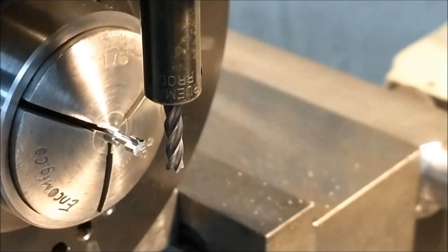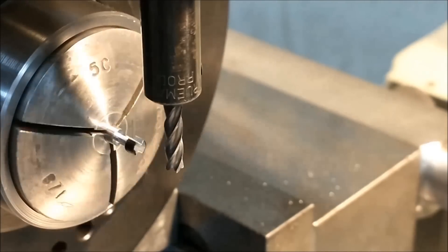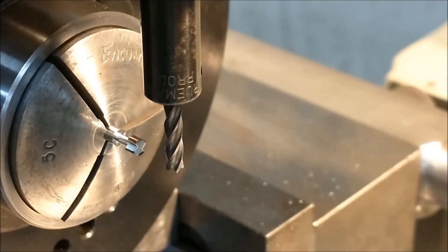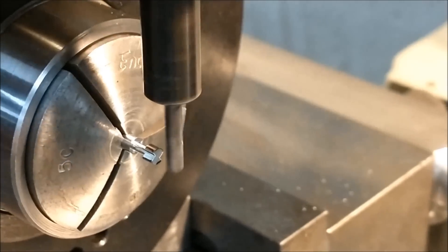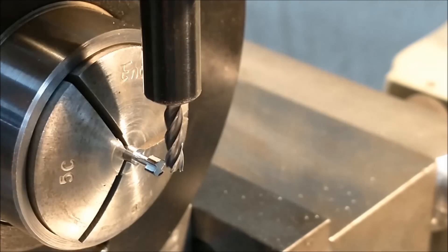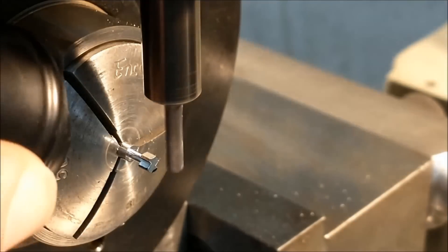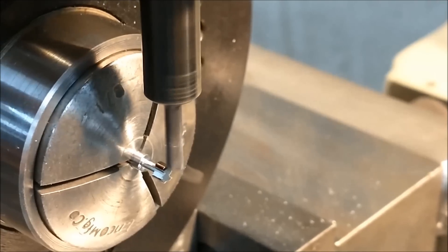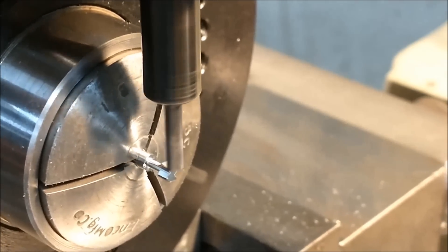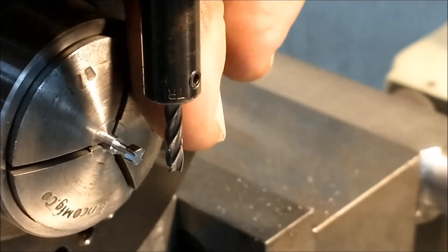Primary relief sufficient would be 5 degrees, 7 degrees on the very first cut to give you a cutting edge. But for what I'm doing — cutting extremely gummy material on a small diameter — the angle isn't really going to have a tremendous effect. The cutter step I just milled in there is rotated to about a 40 degree primary. The top of the blank has been blacked out with a Sharpie marker and I'm coming up with the table until that little area right there disappears. Don't go too far or it will affect your cutting diameter. I'm also planning for a little end mill deterioration, and roughing first to ensure that if the cutter isn't spinning concentric, you don't stress one side more than the other.